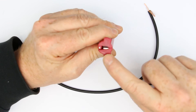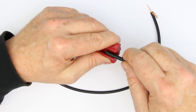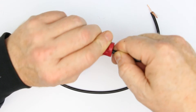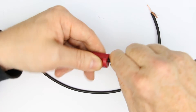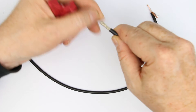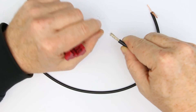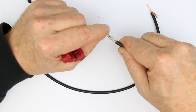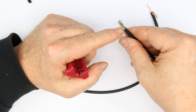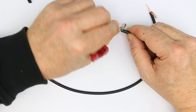The side with a wider distance is to dismantle the outer insulation. You just put the cable inside and without applying too much pressure you turn it two or three times around, and you can easily strip it. You can see there are also a few wires of the outer shielding that have come off, but it's only one or two — so that was already much better, and the cut is very clear and very good.